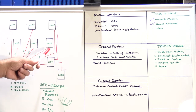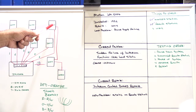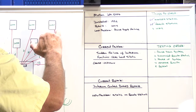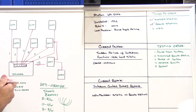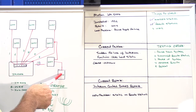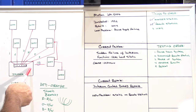These speakers are directly above the garage on the same wall. If it is tied into one of these, it's not tied in on the back of the speaker itself, which is the way it should have been done. It's tied in somewhere, probably mid-run, in the framing somewhere in the house, or maybe in the attic that you can't get to or something like that. So that's why the garage and the workshop speaker came back and worked once I reconnected the wires behind the speakers, while still having the run that was left off the master station disconnected.